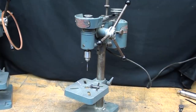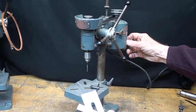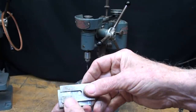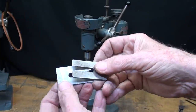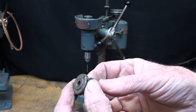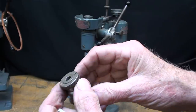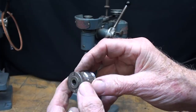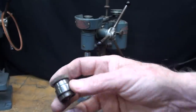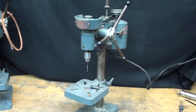Well, thank you, Sam. Thank you for watching. Be sure and watch that video when available on how to make wedges to remove Jacobs chucks. These did work fine without hardening — I figured that they would, because there just cannot be all that much force. They can't be stuck that bad with a taper that small. Now when you get into the larger ones, you might really have to pound on them, and I do show how to take a larger one off in one of those other videos. So watch that. And I guess this is just scrap metal. So thank you very much for watching. This is Tubal Cain saying so long for now.